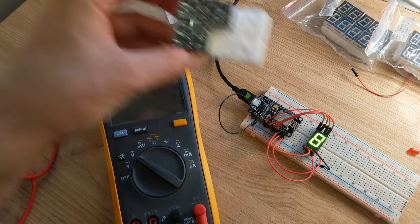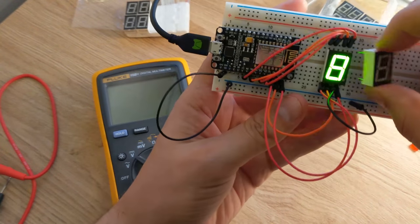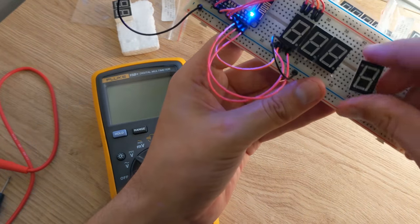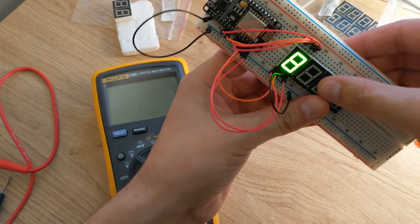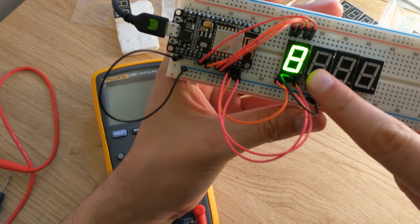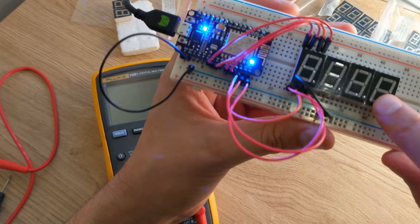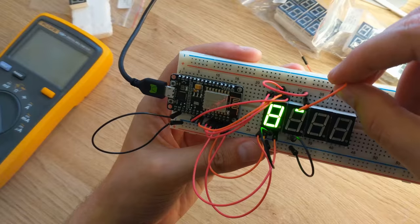I've around 450 subscribers at the moment, but maybe I'll reach 1,000 at some point, so I really need to display 4 digits. This presents a little challenge though. We've used up almost all of the available output pins on the microcontroller just driving the first digit. One solution is to share the 7 output pins which are currently driving the first LED display. We can connect those pins to the other LED displays and they will all display the same number at the same time.